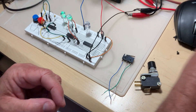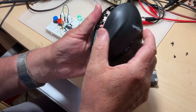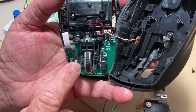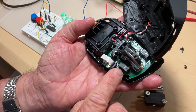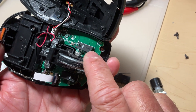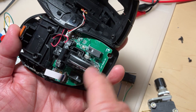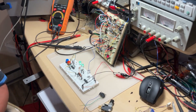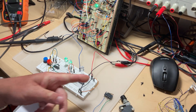This one is very quiet. I even opened the mouse for you — if you pick up any Logitech mouse, chances are you're going to find several micro switches inside. You can see two of them here. One here, one here — chances are they are going to be made by Omron. Omron is a big Japanese company making, among other things, PLCs, so most of the PLCs I use in my demos are Omron.